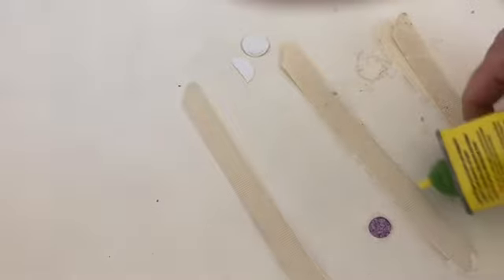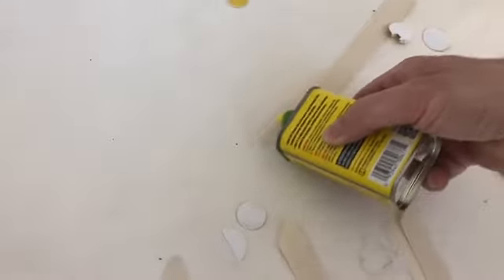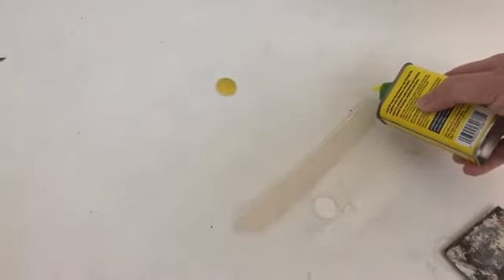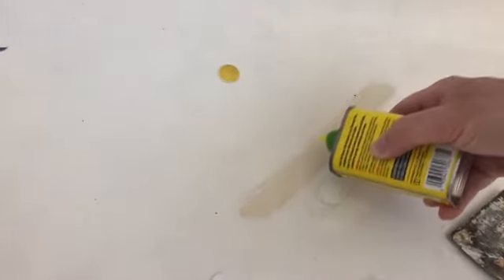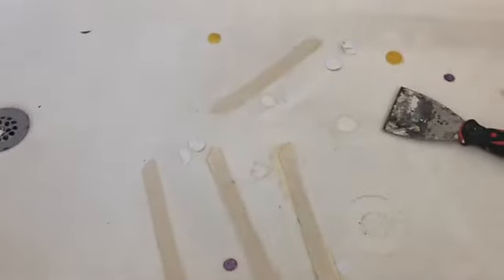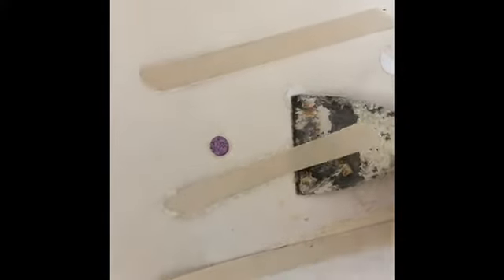Once you put it on, you're going to want to wait a couple minutes for it to soak in and break down that adhesive. Then once you get the strip off, apply another amount of Goof Off to the adhesive that's still in the tub. I'm using a scraper very lightly — not gouging into it, just prying up the adhesive, going parallel to the surface to cut the point of adhesion between the tub and the strip, gently wiggling it back and forth.